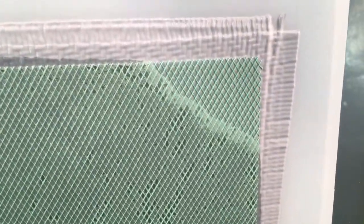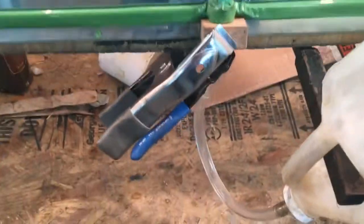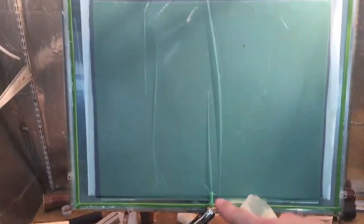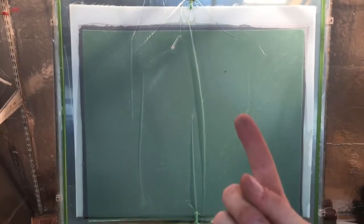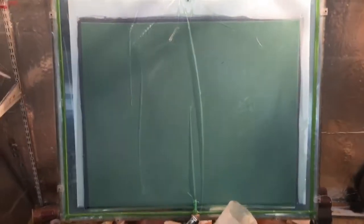We're getting close to the last little corner, finishing up. I actually had a little mess-up getting ready for the video — you can see the trail of bubbles down to the inlet line. I didn't pinch it off in time, but we should be okay since the part is already wet out. The bubbles trail all the way through into the net, so once we de-mold the part we should be fine. Also, any chance you get, you always want to go uphill with your infusion — the simple obvious reason is air always travels up, so there's less chance of any voids or bubbles getting stuck in the laminate.